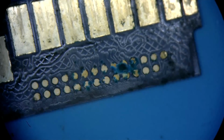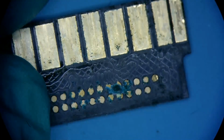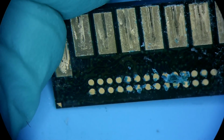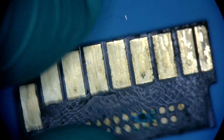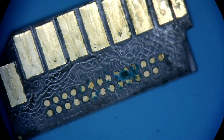Now, they are there not only to make point A to point B contact. Sometimes these test points in the middle will be middlemen. They will be in between the two, and if they rot away, then they break the connection between point A and point C, because point B is not connecting either C or A together. So the recommended thing here would be to strip it down first, see what the circuit is like, and go from there. But I can tell for sure at this point that the interface didn't corrode all the way through. It's not likely for an SD card interface to corrode to a point where it's totally wrecked, but I have a good feeling that something around here corroded enough to break, and there's no more contact as a result.